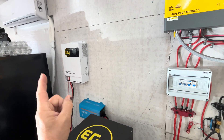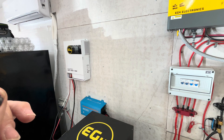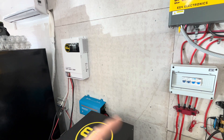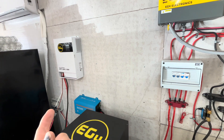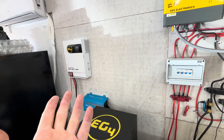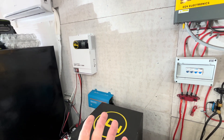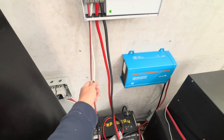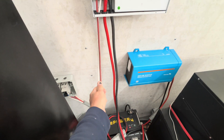To get 6,000 watts with 250-watt panels I had to put four in series and parallel the rest. With 24 panels I had six sets of four in series, all six in parallel — so really high amps, like 8 times 6, about 40-some amps going through the wire. That's 10-gauge PV wire, which maxes out at 30–35 amps, so I was exceeding the ampacity.